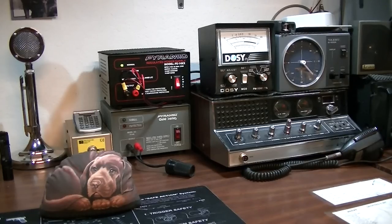The other kind of radio is a base station radio. These plug into your wall outlet and are designed solely to be used inside your house. There aren't near as many CB base station radios on the market. You also start getting into export radios — sold as 10-meter export radios for the ham bands — but a lot of those radios can be converted by a technician who can go inside and do a conversion to allow you to get down to the CB frequencies.